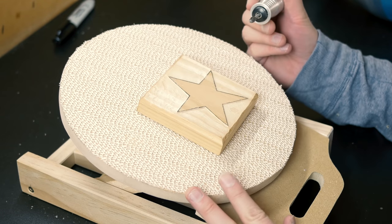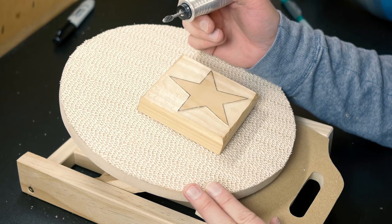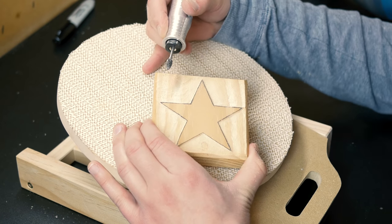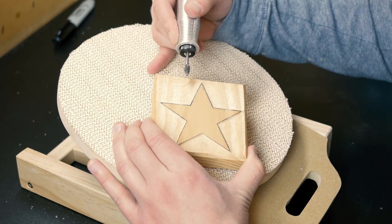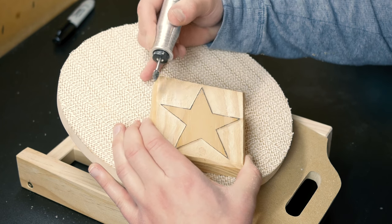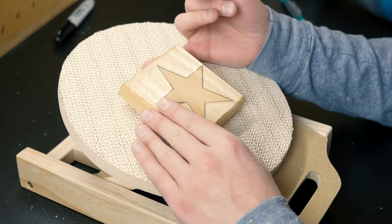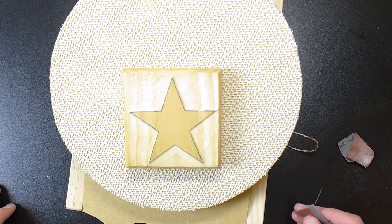Pretty smooth — I could have taken my time and made it look a bit better, but we are going to texturize it anyway. A tip: when roughing out with the rotary tool, go to the left because the bit is spinning clockwise. When you smooth out, go to the right. After I rough an area out with this carbide bit, I'll always go back over it to the right. I want this to be very even and the same height.